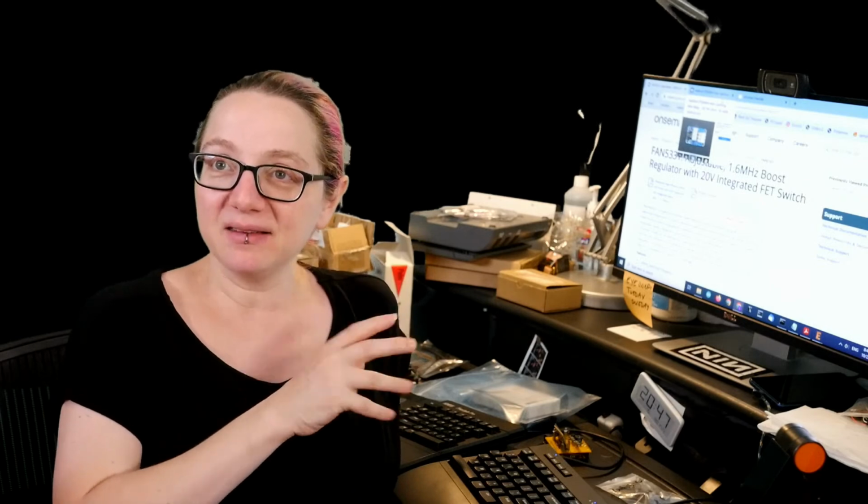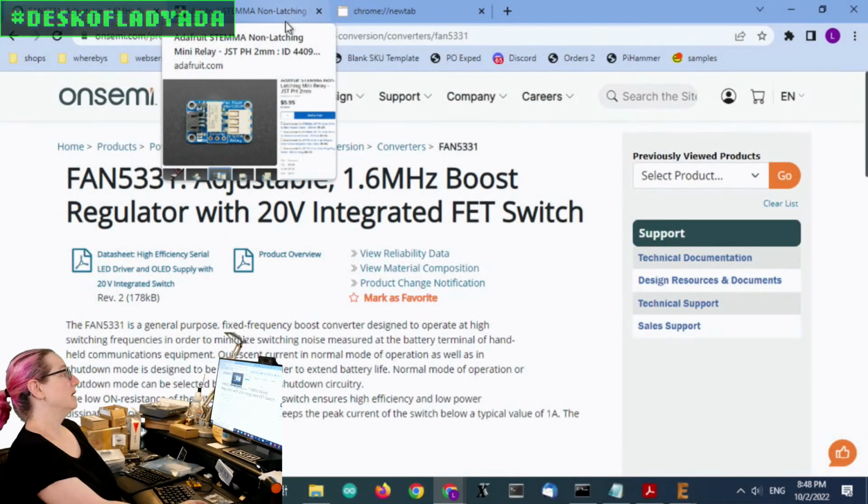As I just mentioned, sometimes audio circuitry also. You'll need plus 12 volts. Even if you're not using a full 12 volts for your audio signal, the rails need to be higher because you need headroom for your audio amplifiers, and they go up to maybe 6 volts. So again, for biasing, this isn't what I would call a power boost converter, although if you only need 100 milliamps, then it'll do the job as well. So let's go to the computer and let's look at this chip.